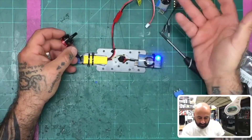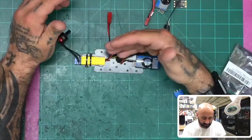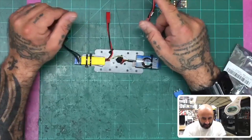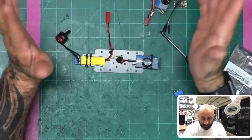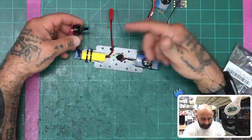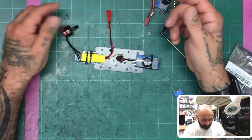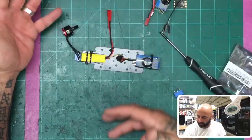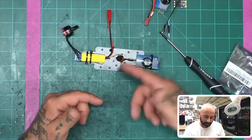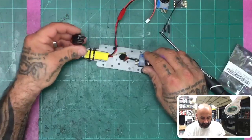The idea was to put something together that allows me to test motors immediately, without having to re-solder anything. It helps me and cuts down a lot of time. Once you set this up, you can start it up and it will work for any motor. You're only using like a 6 amp ESC so you won't blow it. I can test motors now in about two minutes — just unscrew the motor and put another one on.